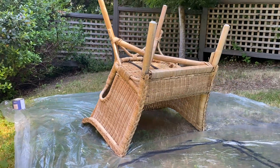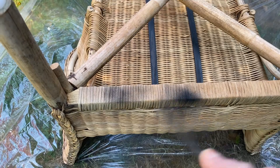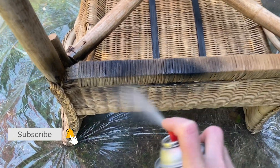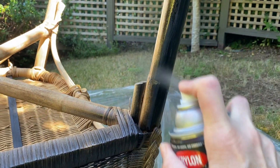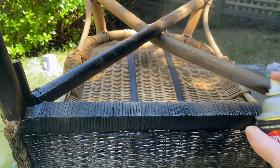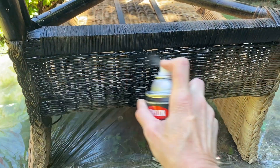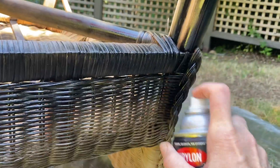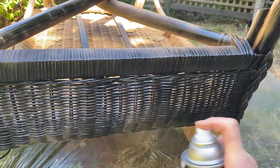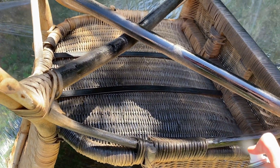I always find it super helpful when doing any chairs to start from the underneath first. There are all those little corners and hard-to-reach areas — if we can get to those first, then flip it around, it will make painting a little bit easier and smoother so you won't miss any gaps. Using spray paint, it's always best to do short little spurts and keep your paint can and arm moving in different directions consistently. This way it won't build up in one spot or drip and run. Since we're working with rattan which is weaved, we want to make sure the paint is getting in between the weave, doing a very light coat as a foundation before the second full coverage coat.